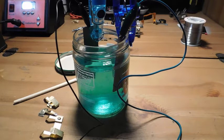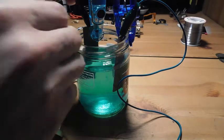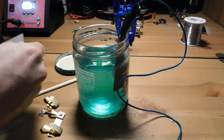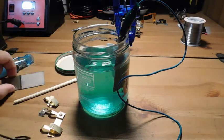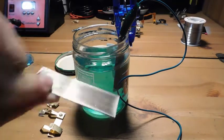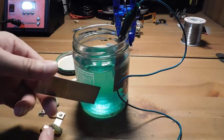It has been maybe about five or six hours, and you can see that the solution is definitely ready now. It's gone from being clear to being a kind of greenish color — that's what you're expecting. I'm going to disconnect the ground electrode and stop the reaction, and we're going to take the anode out. You can actually see a change in the nickel — this is the side that got the nickel removed, and those ions are now floating in the solution. Pretty cool.